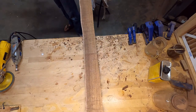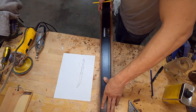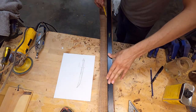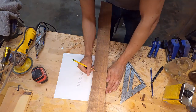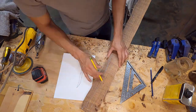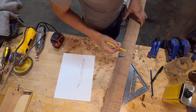So here is the piece. The blade itself is going to be roughly 28 inches in length and the handle is going to be about a third of that. But the handle and blade are not going to be one solid piece — I'm actually going to do it similar to a katana where it will have a handle that it goes through and then pegs together. The first step is just making the blade itself with the tongue section of the handle, and then once I get the blade finished I can start working on the cross guard as well as the handle section.